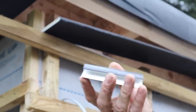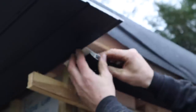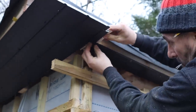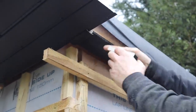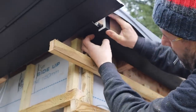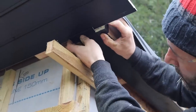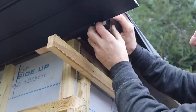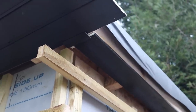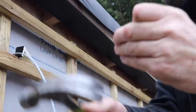You can see how that H trim slides on there — it'll also slide on the other side like that. I want to push that back so it just slides up to the soffit, so when the fascia is on there it provides a nice finish running straight through. To take the heads off the poly tops again, just get them in the hammer and pop it off.